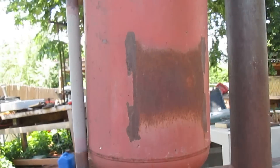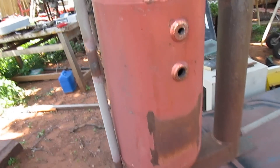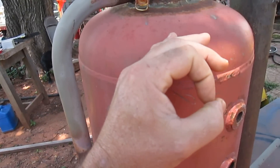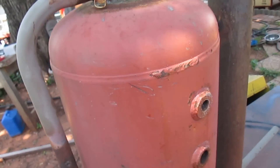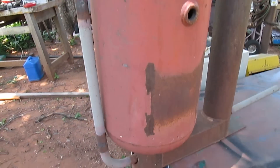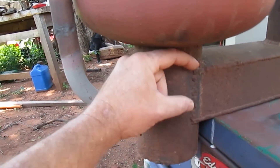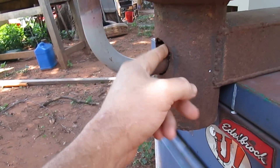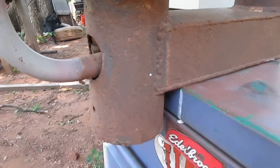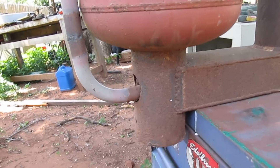This is just a typical rocket stove as far as that goes. I've got a steel tank mounted on it made from an air compressor tank, and if this is filled with an inch to inch-and-a-half diameter round sticks cut to about an inch or so in length, they tumble through okay and down into the burn chamber — which isn't finished. I don't have a lighting hole with an air adjustment in it, and this pipe hasn't been sealed to the chamber. You can see it's still full of wood. I've burned this thing — it's been about five years ago — which is why I'm going ahead and turning this loose so the next guy can run with it.